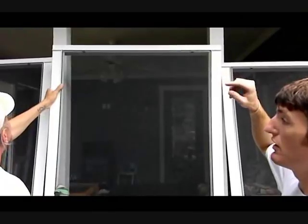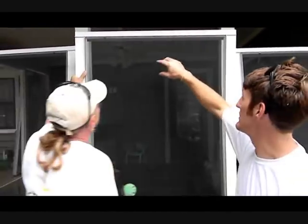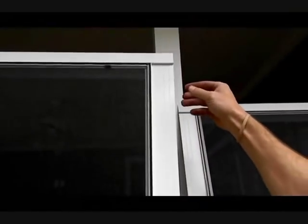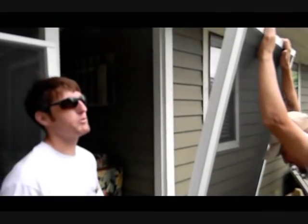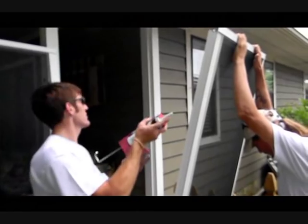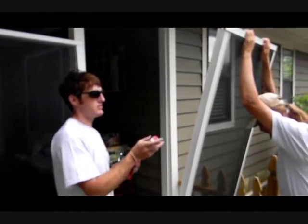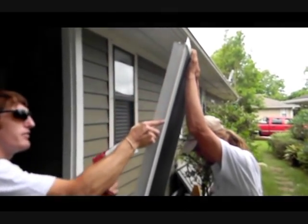Because we are going into wooden posts, we are using wood screws. Brian is pre-drilling holes for the wood screws. They make two little reliefs here, and to be consistent with your installation, you want to try and hit either the inside or the outside one with all the holes you drill. Before you install the window, because this is wood and it's painted, don't use silicone — use some sort of acrylic latex so that you can paint it. Just put a nice bead right behind the flange.